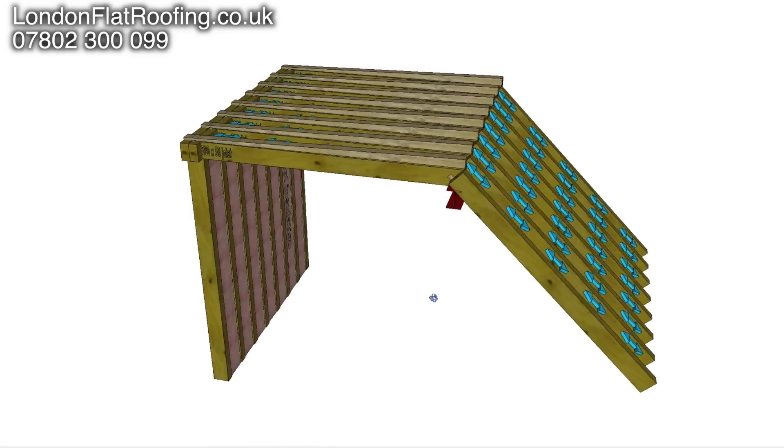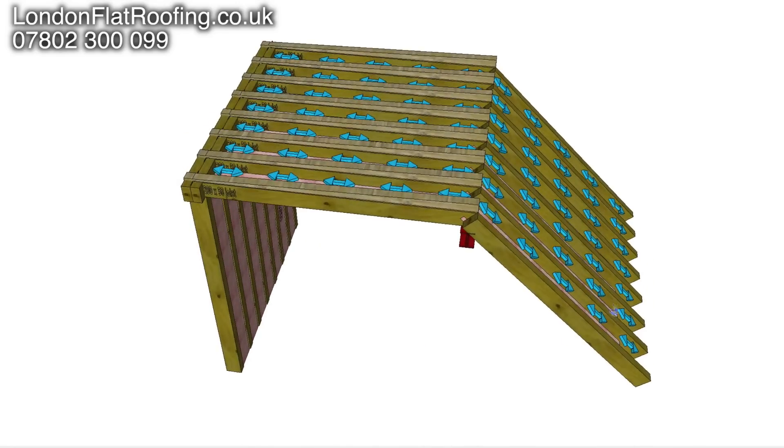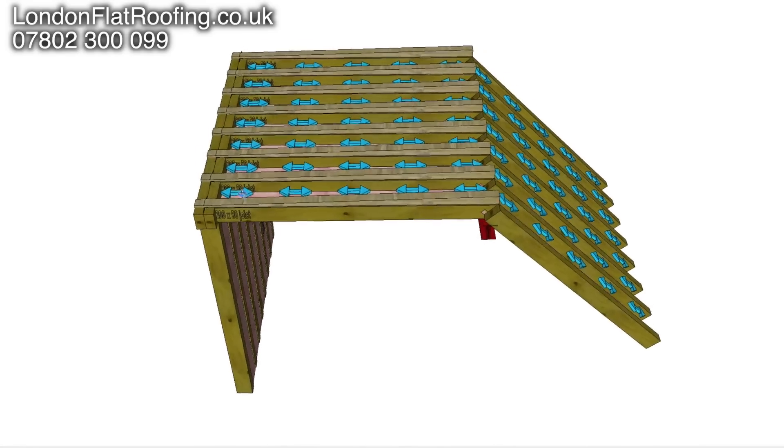The interesting thing is that at the moment this is a cold roof, and ventilation should be from the very bottom here, where the gutter board is, right away through, either stopping at the front here and restarting on the roof. On this particular roof that we did, it actually went from the very bottom here up, across, and down, with venting also on the top of the roof. So there was a lot of areas where new air could enter and old air could exit the roof, therefore venting the roof completely.